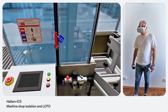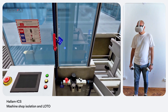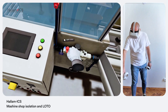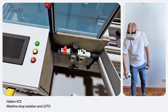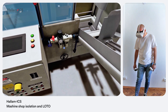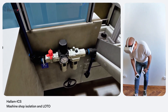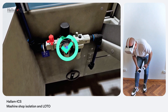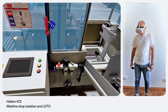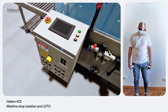Next, remove the LOTO devices from the main shutoff valve for the pneumatic system and open it. LOTO removed and the shutoff valve is now open. Good. Now turn the main safety three-way valve on the FRL unit. Now let's confirm that pressure is returning — check the pressure gauge readings on the FRL unit. Pressure is coming back. Great. Now let's move to the electrical side — start by removing the LOTO devices from the main safety electrical switch.